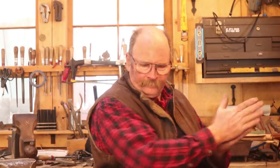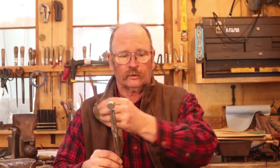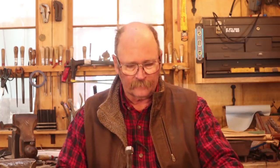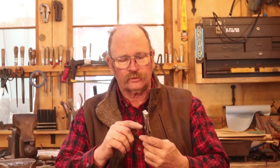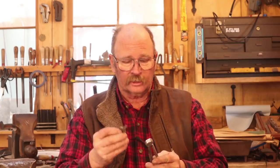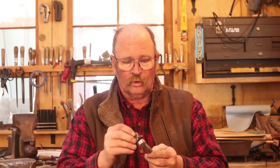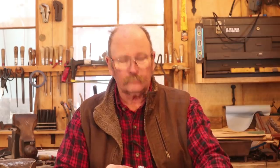We have our dividers all filed clean and bright with a nice file finish. I went over them all with a second cut file so it's a little bit smoother than that first pass. Now we're ready to do some of the final work. We need to shape our wing so that it actually curves up like the wing on the old dividers does. We'll need to measure from our pivot point to the slot that the wing travels in to find out what radius we need. We also need to drill a hole for the thumb screw — this is quarter inch fine thread, or quarter by 28 threads per inch, so we need to look up what size tap drill that is.